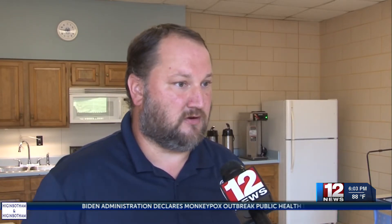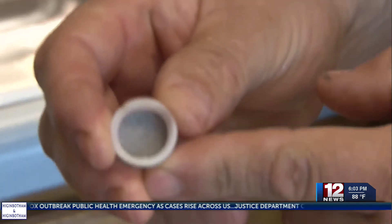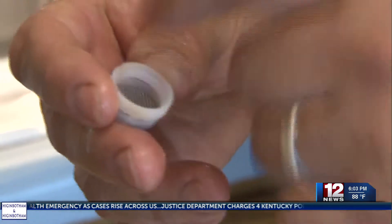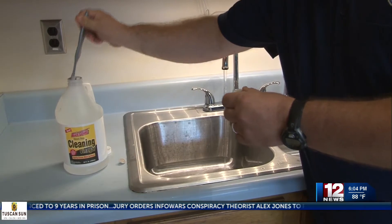It's not difficult at all. Davis recommends that you clean out the aerator in your sink at least once a month. We've had instances where we actually went out and somebody had tested for lead and it's been high. We go out to run sequential sampling, which is a series of tests, and we'll take the aerator off and it's jam-packed full of stuff. So when we run our samples, we get lower values than what it really was because of the buildup in the screen.